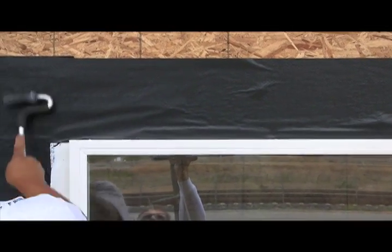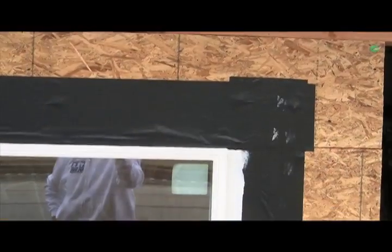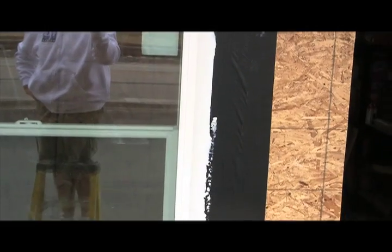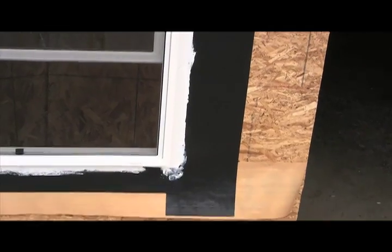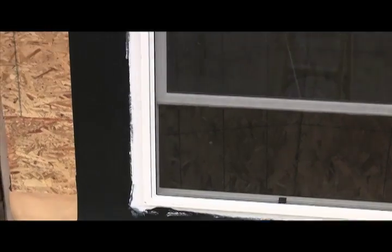After the top flashing is in place, you J-roller it, just like you see Percy doing here. And the finished product from the outside should look just like this. You can see the gaps on the lower nail fin where there is no sealant.